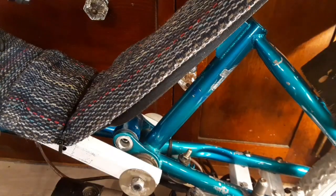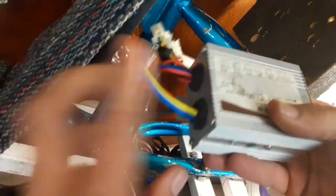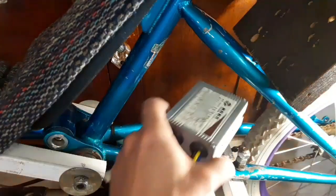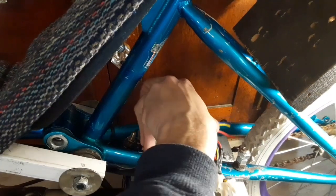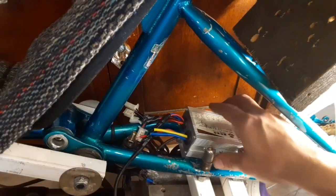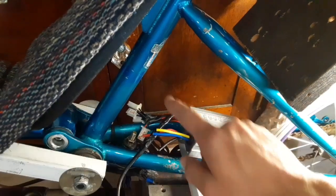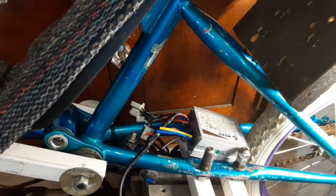Wiring in this new controller is not that hard — you have power and motor leads. I'll have to look up which ones go to which because I don't want to blow up the box if I hook it up backwards. We can set that little box right about there — if you turn it sideways we can mount it kind of like this, or flip it the other way so the wires don't go into the tire. That looks nice. We'll mount it like that, and if we can keep the voltage controller kind of low maybe I can get one of the 20 amp-hour batteries in here and just one up in the battery holder, which will really reduce the center of gravity and make it more enjoyable to ride.